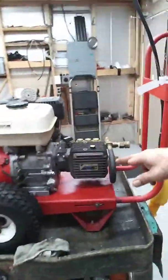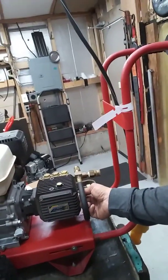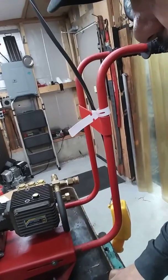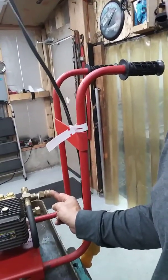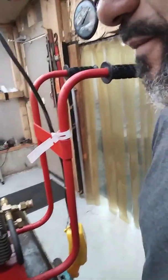We're changing the oil in the pump. The other mechanic didn't change the pump oil either. This pump oil is 25 years old. And the sight glass was leaking and filthy. You couldn't see through it. I've already fixed that. And he needs a 50-cent O-ring in here so that he can properly connect his hose. His O-ring is petrified, so he can't even stick his coupler in there.